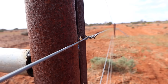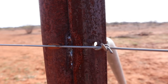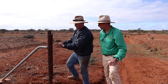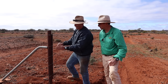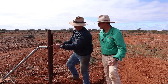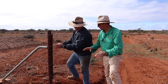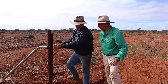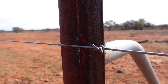If you look at where it's welded on, it's not welded on the face, because when the floodgate opens up behind us, it's going to be putting pressure onto the sharp edge of the star picket. So we've angled the star picket around the side a bit, so the pressure of the wire is actually on the post, giving a bigger surface of pressure — almost a round surface area for the wire to stretch around. And because we're on too much of an angle to put a normal clip on, we've just twitched that on with wire.